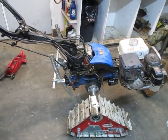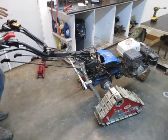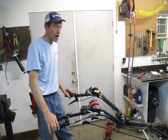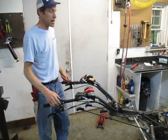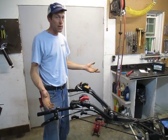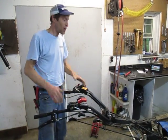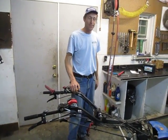When you're using the tracks, steering is almost exclusively with the independent steering brakes located up on your handlebars. On the Grillo they're both on the same side. With the steering brakes this thing handles amazingly well — you just brake one wheel and it crawls around, sounds like a tank. That concludes this segment. Thanks.